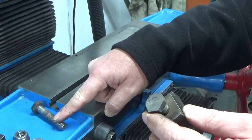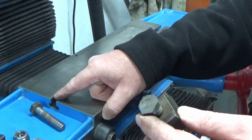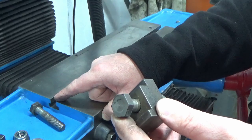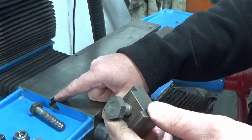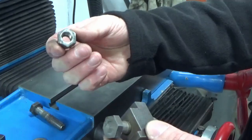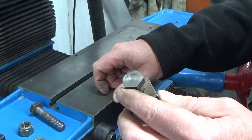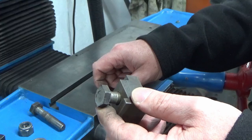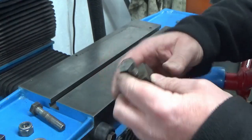These are going to be half inch Whitworth probably. I'm probably going to go from half inch Whitworth to M12, make the T-nuts up to the right size and shape, and then we'll go for an M12 thread. I've got some M12 studding, and then we'll put some nylock nuts on the top, the same as what's already on, but in metric. So that'll be the next job. I'll probably not film that. I've filmed making T-nuts in the past, so it's going to be the same process.